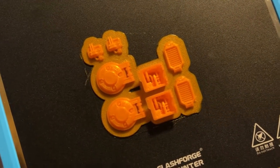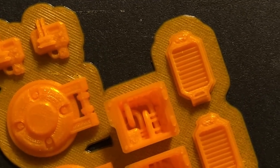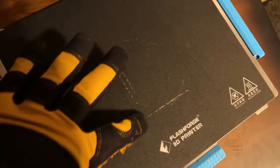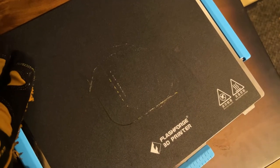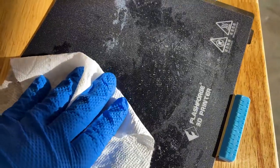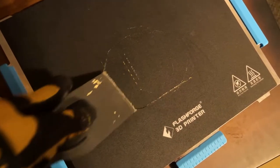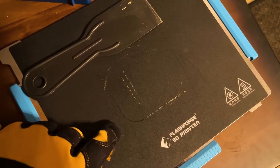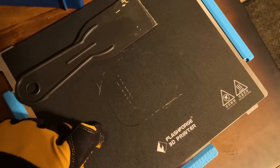This is just a quick addendum. I did want to mention that the printer does well printing out tiny stuff too. These are some random greeblies that I printed out, and you can see the detail is pretty darn decent on these very small pieces. One other thing I did want to mention: the Flashforge Adventurer 4 does have a textured print bed, which can make the residue from prints rather difficult to remove sometimes. I haven't quite figured this out yet. I did make one huge mistake — I tried using some spirits to get it off a build plate previously and basically ended up ruining that build plate because the mineral spirits just ate right through the textured print bed. So don't do that. You can certainly use a plastic scraper; some people use metal scrapers. The way I usually deal with it is heating up the print bed and then it gets a little more mushy and you can get it off. But I have residue from previous prints that I haven't been able to remove, so that's something I'm still working on.